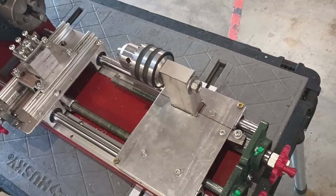The linear rails I planned to use happened to be too long, so I decided to cut them to the required size. This is an extremely tedious process — using a carbide blade to get through the hardened steel and a standard blade for the aluminum. I was finally able to use brute force to snap the rails at the cut mark once it was scored deeply enough.